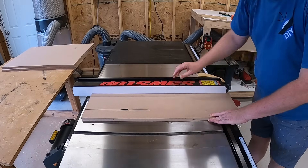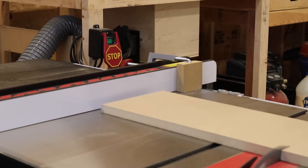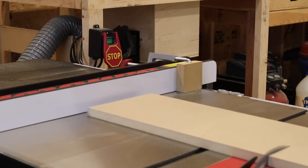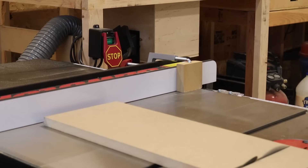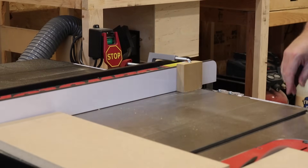Now the front, top, and bottom are going to be cut just a little bit oversized — more on why I did that in just a little bit. For the sides and the center brace, I grabbed some scrap pieces from a previous project and set the fence to 19.5 inches, then clamped a one-inch block to the fence.